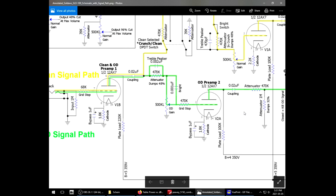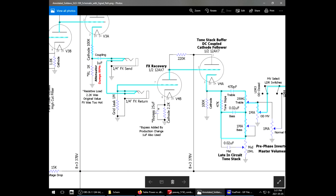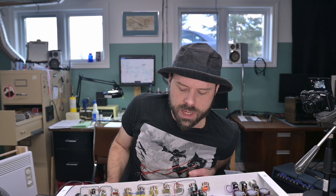Now there's two things that go on. When we change it to the 1K, yes there's less output, but there's still too much output. And then the recovery — adding this bypass capacitor — it's a quick and dirty way to boost the gain of the recovery so that it can compensate for the attenuation that's added to the send. Using a bypass capacitor doesn't just increase gain, but it increases gain within certain frequency responses. That's one of the reasons why it's commonly used up in the beginning of the preamp to shape your tone — it causes the tube stages to become responsive to certain frequencies instead of all of them, so you can focus on which you want to boost and distort.